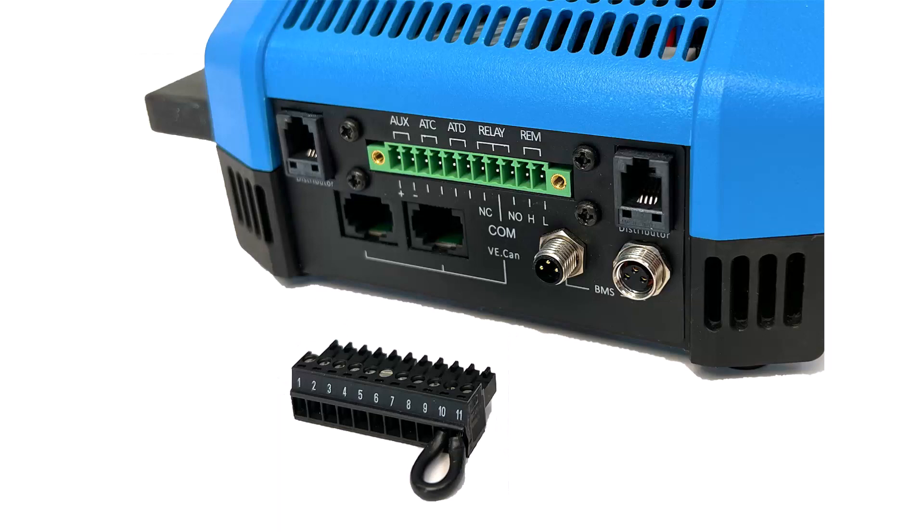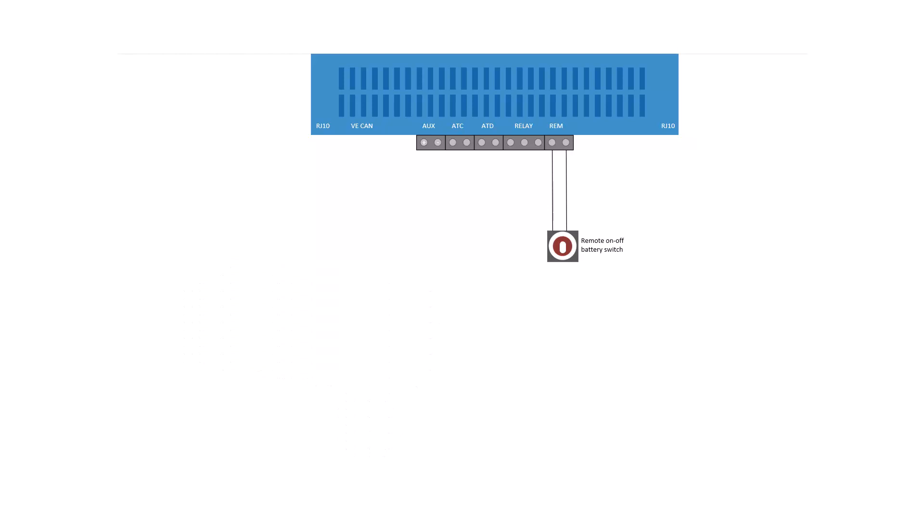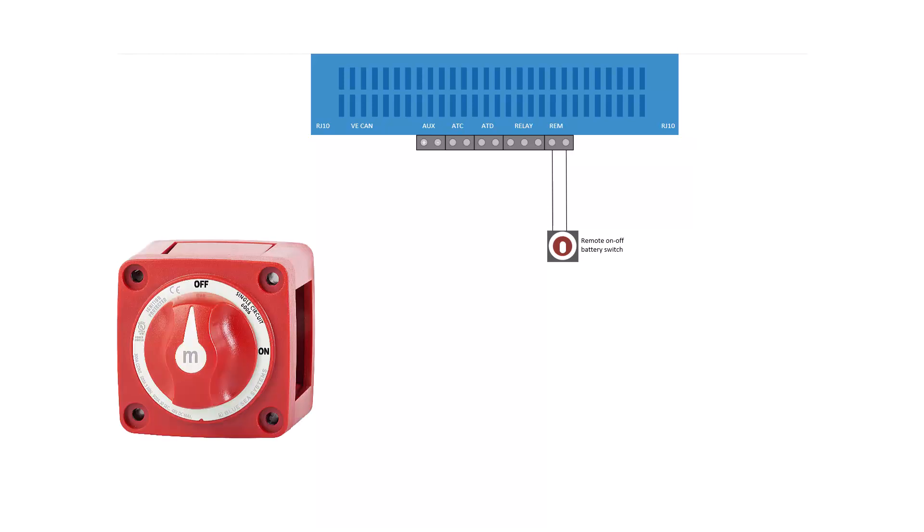To simplify our drawing, I'm going to hide all the connections we've spoken about before, because the rest of the video is all about the connections for the terminal block. The first thing to notice is that the terminal block has a little wire jumper that joins the two right-hand connections — this serves as the on/off switch. If the jumper is removed or if the whole terminal block is unplugged, the system will be off. You can permanently remove the jumper and replace it with a two-wire connection to a remote switch. This can be any switch of your choice, and there's almost no current flowing in the circuit, so it can be as small as you like.